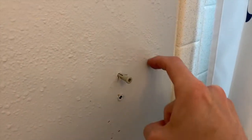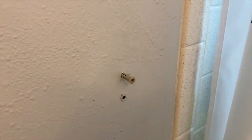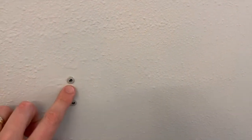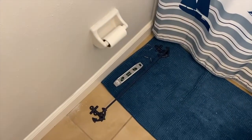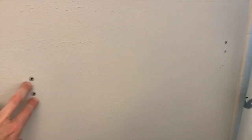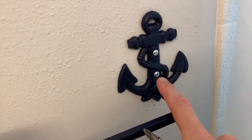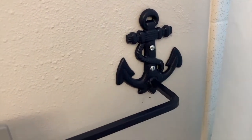The last thing you want to do is push this in very hard and damage or crack any portion of the surrounding drywall — that would not be good. Making progress: the three remaining drywall anchors are inserted. Careful as you push these in until they are flush with the wall. Now we'll pick up the towel rack, align it with the holes, and secure it. In the event that you have studs, you won't need drywall anchors. I went ahead and shifted the towel rack in place, centered it with the holes, and carefully inserted the screws.